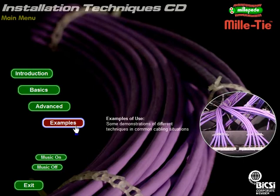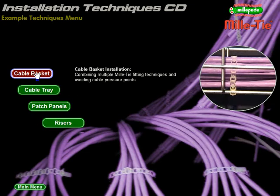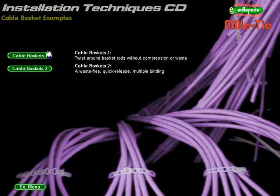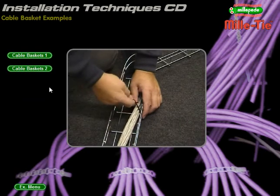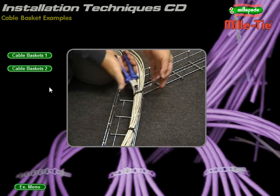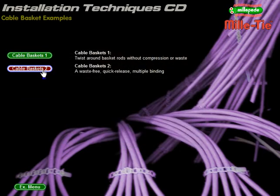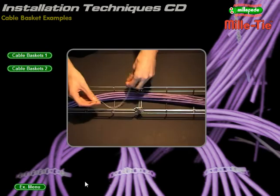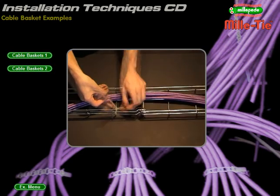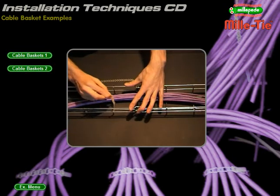Examples: using the Millitie in common installation scenarios. Cable baskets: using Millitie's flexibility when working with baskets. Example 1 — simple cable basket fitting: use Millitie to install cables with waste-free single wraps. Each Millitie can easily be used three or four times. Note how Millitie twists, allowing both cables and baskets to be bound with a single strip. Example 2 — combining fitting techniques: a single wrap is fitted around the basket but the end cell is skipped, which is used to multiply bind the cables. The tongue is then reinserted and the remaining strip is removed and reused, creating a waste-free quick release tie that is especially useful for temporary cabling.